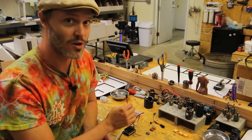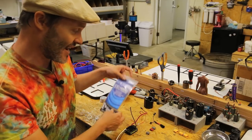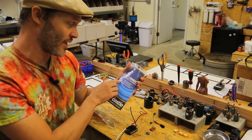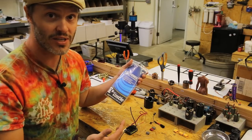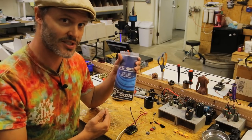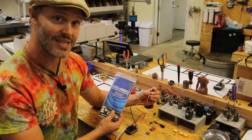However, in the radio control rock crawling field you need more power for your servo — it's really needed. So what we have is an external BEC. This is the CC BEC made by Castle Creations, and this one is selectable from 4.8 to 9 volts output. We're going to set this to whatever the radio needs or whatever the servo actually needs depending on the use. For rock crawling, we're going to power this up for whatever the servo wants to see, so probably about 7.4 volts. We need to make sure that the internal BEC does not cross-talk with the voltage coming out of the external BEC.